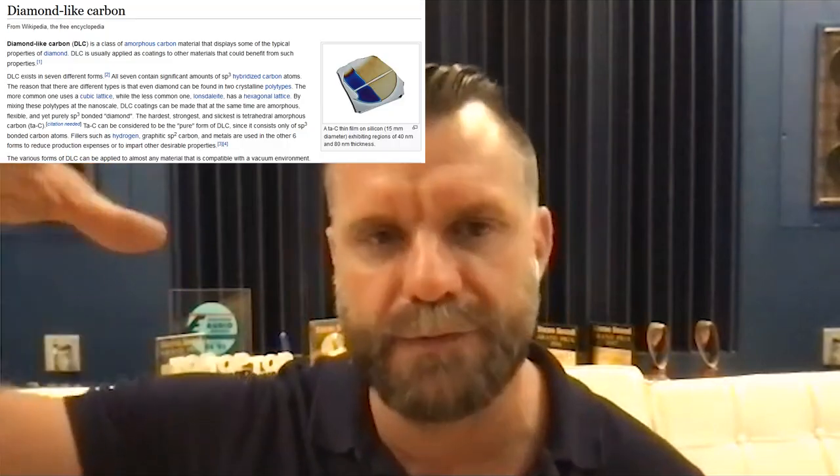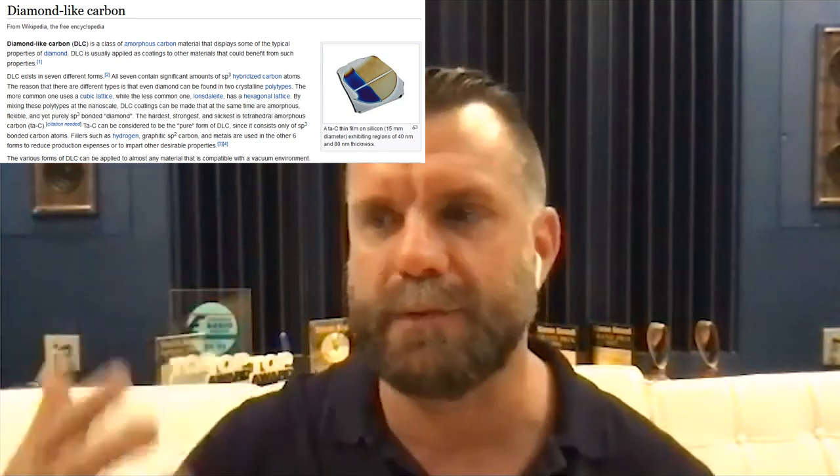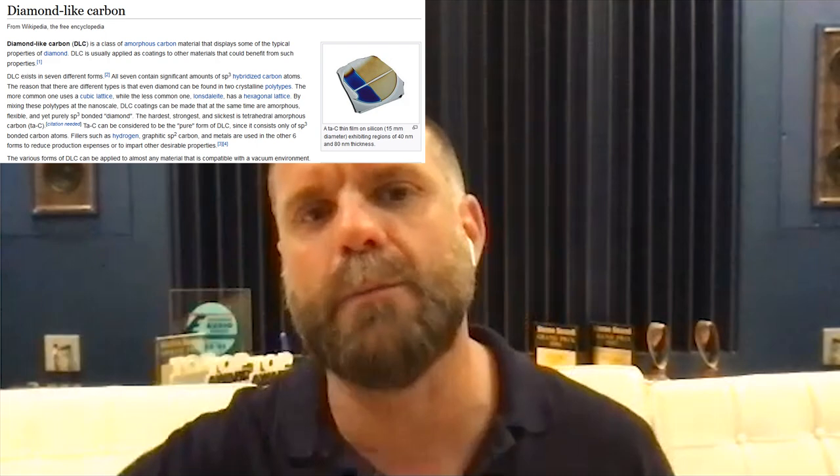So basically, we knew that to keep all the good properties of a beryllium diaphragm but make it sound more natural, we needed to address that peak. And we did it through a very complicated, expensive chemical process, which is capable to change the mechanical properties of the diaphragm almost without affecting its weight. This chemical process is the deposition of diamond carbons on top of a beryllium surface. Thanks to this, we are capable to move that resonance peak up 10kHz higher — from roughly 25kHz up to 35kHz — which makes a huge difference to our perception.